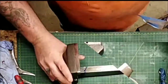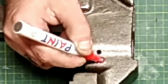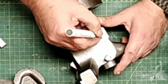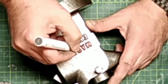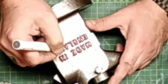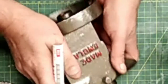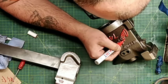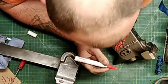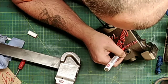Get this bit of tape off and then it's time to highlight the letters - I've gone for red on this vice. Out of all the ways I've tried, I find these pens the best for highlighting letters - they're oil based paint, they last quite a long while. They're about one pound fifty or two dollars a pen, or you can get a set of twelve for about eight pounds. Generally it's about two passes with the pen over the letter to get a good coverage. I think the red in contrast with this paint is a fantastic match - they go really well together, especially on this side where the Record italic writing is a bit thicker - the red stands out fantastically against the oil rubbed bronze.